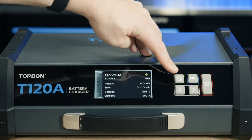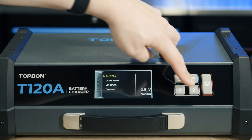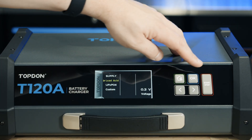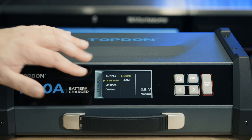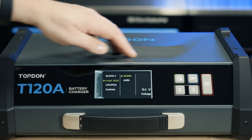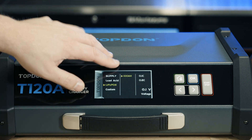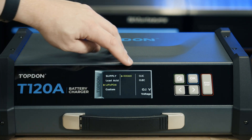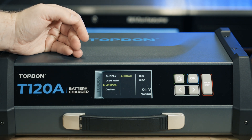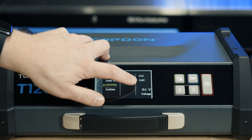We'll hit the start/stop button to turn it off and go back. You can see we pushed a little bit of voltage into this battery, but this battery is very, very dead. For lead-acid mode we have normal and AGM — use normal for standard lead-acid batteries and the AGM setting for AGM-style batteries; that's just for charging, not for voltage supply mode. Same scenario for lithium iron phosphate — hitting that will set up a charging operation. For any of these charging modes and custom mode you also have a charge rate setting: a slower charge, which is better for rehabbing or recovering a battery, and a faster charge for a healthy battery that's just in a lower state of charge.